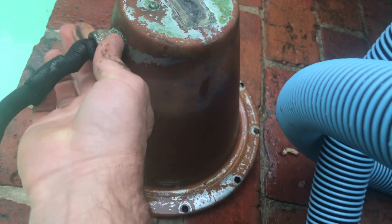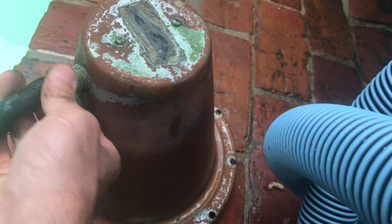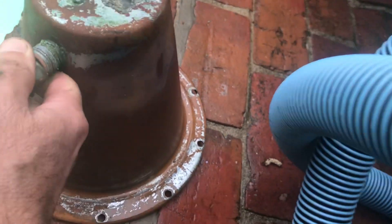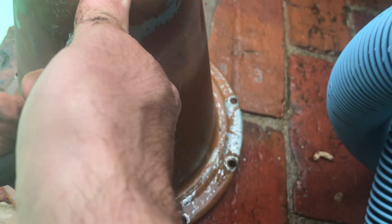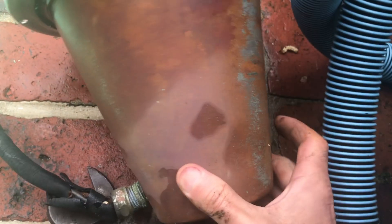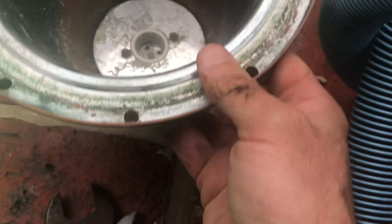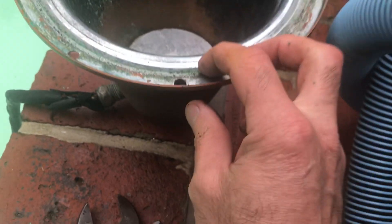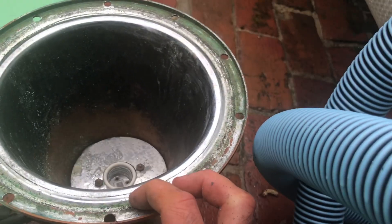This is just a regular 120-volt socket in there, and this light is really old. It's cool that the outer bezel was copper, and I can see that this has got a seal in here before the wire goes in, but unfortunately this outer seal is toast. So I don't know how in the world that makes a safe connection, but I think it's all reliant upon none of this leaking. Really, this light's got to be replaced, but it's possible I could just replace the wiring and try to make sure it all has a good seal.